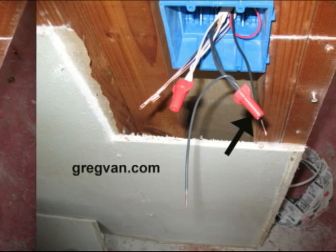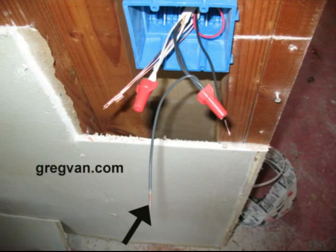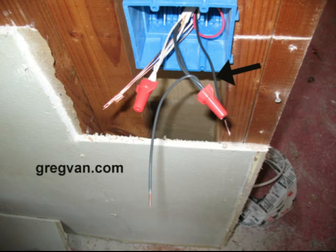This is going to be the light switch, so the wire you are looking at there is going to connect to one of the light switches. There will need to be another one installed later to connect to the second light switch, so this one here will be hot. Now the other black wire you see here is going to connect to the light fixture itself. Not all black wires are going to connect together, and they should be marked thoroughly if you are remodeling or doing any type of electrical work.